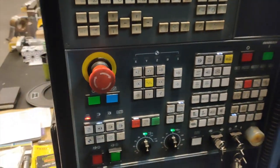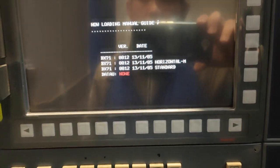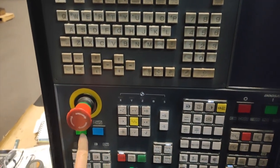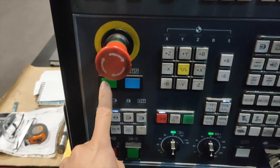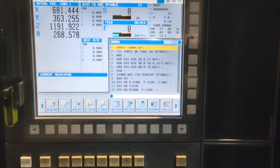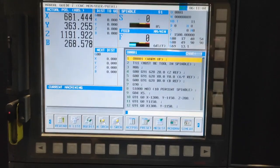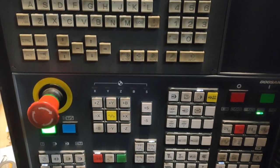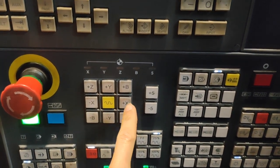The lights are now powered on. We're just going to wait for a few moments — it's now powered on. Release the emergency stop and press the green button to clear all the alarms. Once you hear that sound, your machine is ready to use. We also need to reference our axes: Z, Y, X, and B axis.